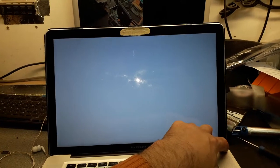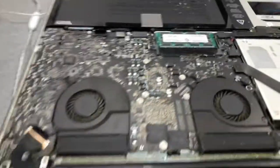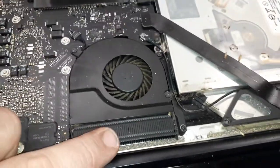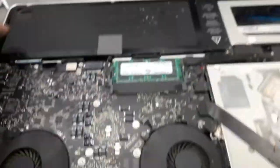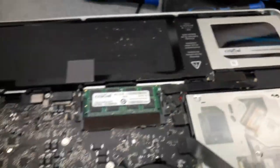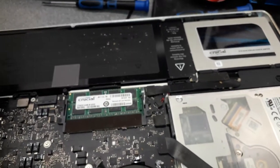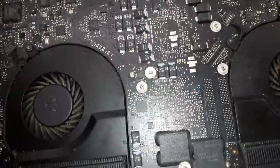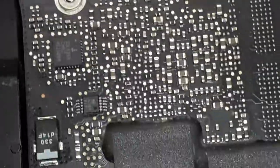Going into the system you're going to get blank screens and you will not be able to boot into your system. I already opened this machine and took the screws out. Looking in here, there's some dust but it's worse than that. We got an SSD hard drive - it's very dusty inside, like it always comes like that. We're going to take this apart and check what's up with the GPU. Apparently it looks like nobody has done a reflow on the machine before.